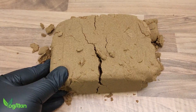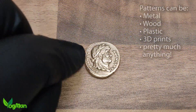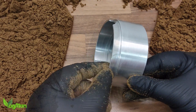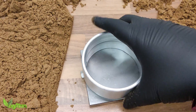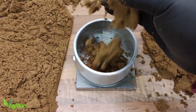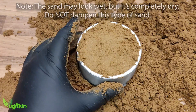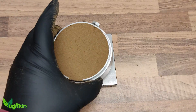The sand bonds to itself very well, so it needs to be broken up and possibly even chopped. All sand casting requires a pattern to duplicate and I've opted to recreate this Roman coin, which is a bronze casting I made a while ago. We need to start with the bottom half of the flask that has a recessed lip on it. Simply sprinkle some of the sand inside and begin to compact it with your fingers. Repeat the process of filling and compressing until the flask is overly full, then take the straight edge and scrape the excess away. Rotate the flask 180 degrees and you should have a nice flat surface.